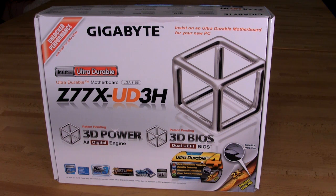Of course, you have support for SLI. You have UltraDurable 4, which is their fourth generation of the UltraDurable line — one of Gigabyte's big features. It's going to give you high temperature protection and humidity protection based on the fact that they're running a different type of fiberglass that prevents moisture from getting in between the layers of the PCB. It's going to help improve the lifespan of the board as well as allow you to cool it more efficiently because you don't have moisture buildup. You also have electrostatic discharge protection built into the board and power failure protection.